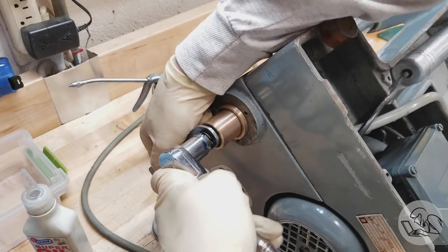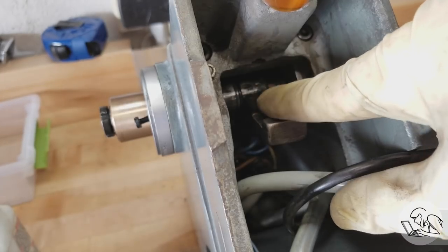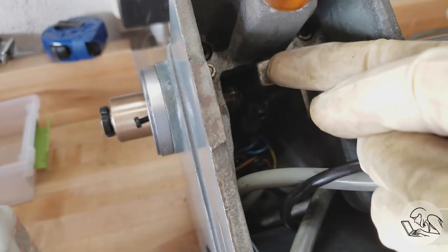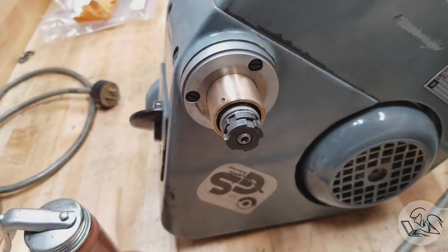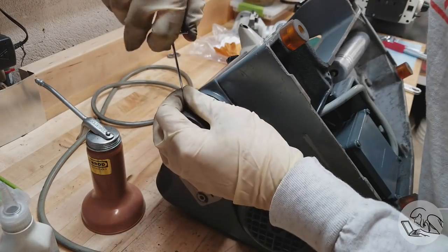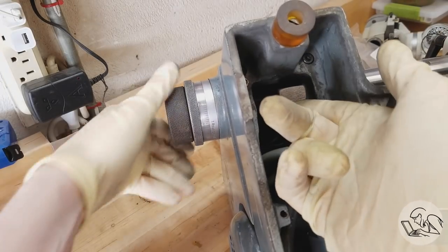This micrometer assembly at the end here — I actually had to take this thing apart and reassemble it about six times before I got it right. There were tricky aspects to getting the lateral alignment just right. You have to get everything arranged so that this arm lines up with the hole where that stopper screw comes through, and yet the micrometer nut has a lot more movement on it than is necessary, so you kind of get to choose your horizontal spot for the entire assembly. I eventually got it figured out, set the backlash with those nuts, and put the dial back on. When you've got it set up right, the stopper arm acts as a lateral stop against the casting, giving you the full half-inch range of motion.